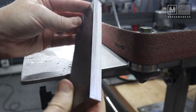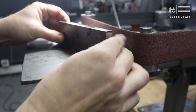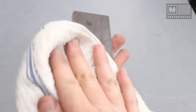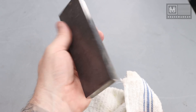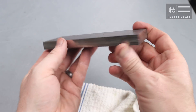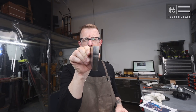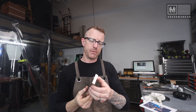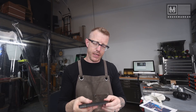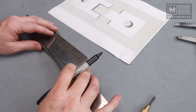Now we've got the bar stock all made. You may not have to do that step — you can just go out and buy a piece of two-inch bar stock. This is six inches long, a little more than I needed, but if I mark my lines this way I might have enough left over to make another tracking mechanism. You can see how easy it is with the Revolution 2x72 to achieve really precise, clean, flat lines — that's part of the design of that grinder. I'm going to mark down all my measurements using a caliper and then cut these pieces out on a bandsaw.